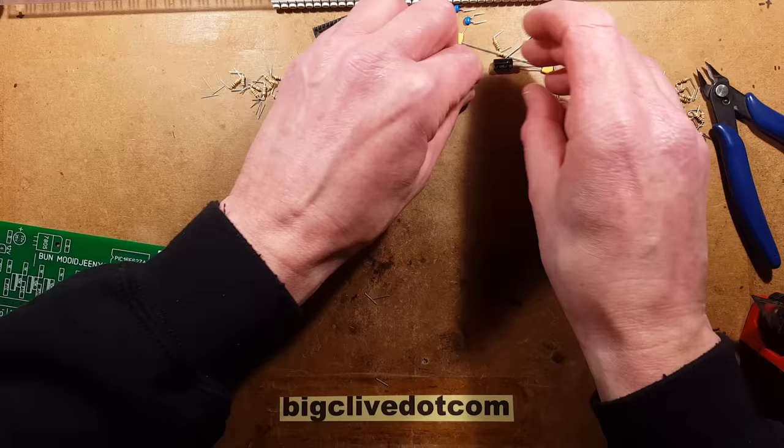That's all the 10k resistors in, and all the 1k resistors in. The link — let's solder. There's one other component I'll stick in: it's the 1N4001 diode for polarity protection. I always put that in because someone is going to connect the supply up wrong, and the only current it has to deal with is the current to the microcontroller control circuitry, not the actual high-current side of these MOSFETs. Now I'm going to put the cover over the top of this, latch it down at the side, flip it over, and start soldering.